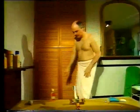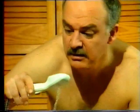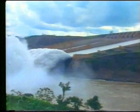In this bathroom, the hot water comes from a tank in the cupboard. So why isn't there much pressure? And how can he get enough pressure to shampoo his moustache? The further the water has to fall, the higher the pressure at the bottom. You get very high pressure if your water starts from a great height — so where would you look for the cold water tank in the house where you live?